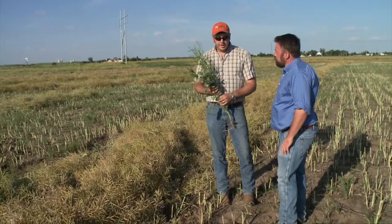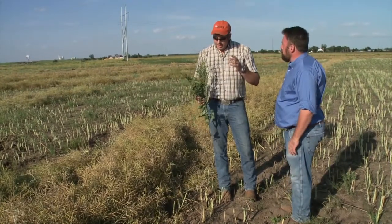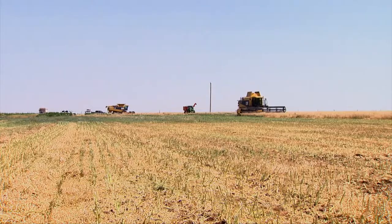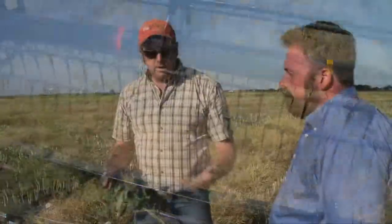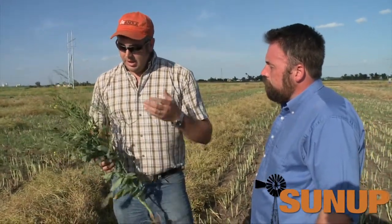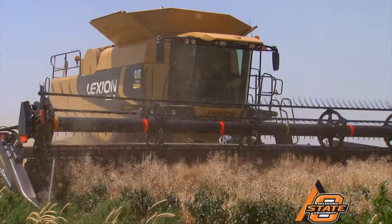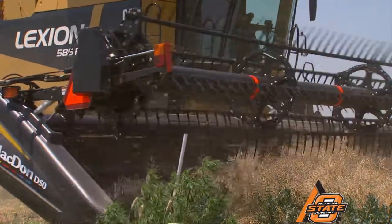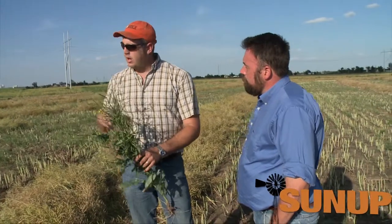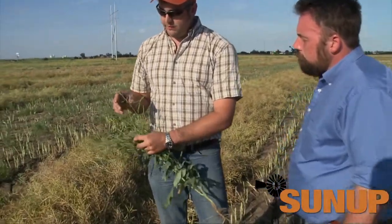Some guys that are starting to straight-cut — regrowth is a huge issue if we're trying to direct harvest, straight-cut it with the combine. Because that stuff we're going after is ripe, but these flowers, these green pods, these green leaves, when it gets chewed up in the combine, it spikes that moisture. Guys cannot deliver canola grain above ten percent moisture; they will reject you at the elevator. So trying to figure out how to get that seed without chewing up that much green material — opening your concave, slowing your cylinder down, slowing your rotor down — to try to prevent chewing up all these leaves and green stems if your seed is ready.